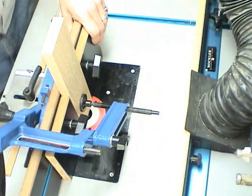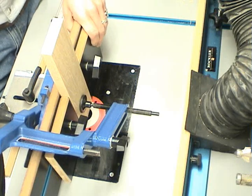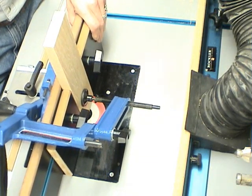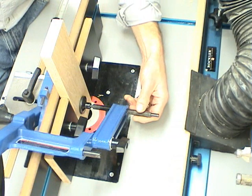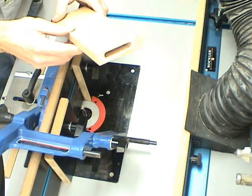It's time to make the mortises in the end of the cross members for the imposter table. This will receive the loose tenon. So on the router table, I've mounted the piece into a tenon jig, and I move it back and forth while raising the bit with the motorized router lift to cut the mortise. Nice, crisp, clean mortise every time.